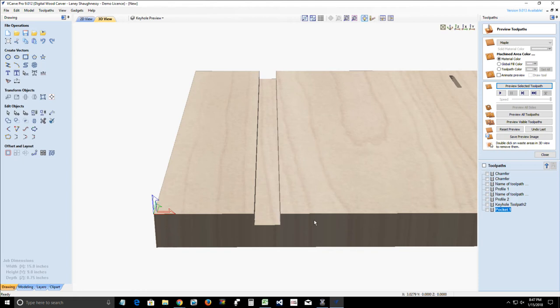Have a tape measure with you, Peter, some form of ruler. It would be great if you had a ruler that had 16ths or 32nds on it, but a regular tape measure, have some kind of measuring device with you, because we've got to calibrate the machine and tell it how far it actually moved when we tell it to move 1 inch or 10 inches, so we can adjust those steps per unit.